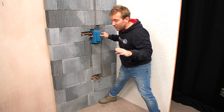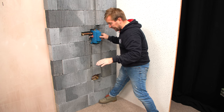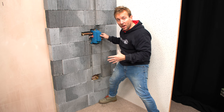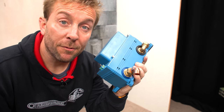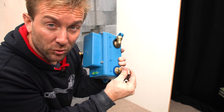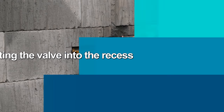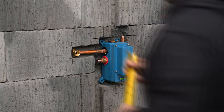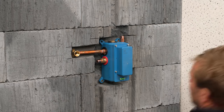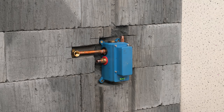Now that we've got that done, let's install the valve in the recess. We've got our lovely recess depth — this pipe is going to go around here, that's going to go down there. The first thing I'm going to do is get a couple of stubs of pipe sticking out because we won't be able to get in here to undo and do up those compression fittings in the wall. Another great thing about using Thermalite bricks is the fact they take screws so well and you barely have to plug them. Vitra do supply plugs and screws for brick walls. The main thing is you're going to have to adjust each corner and use a spirit level to make sure that our valve is flat on the wall, and then use our expanding foam to really fix it in position.